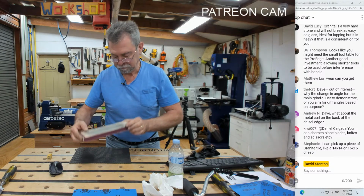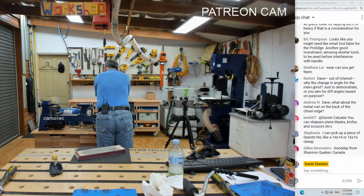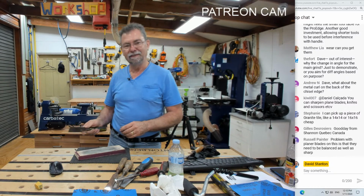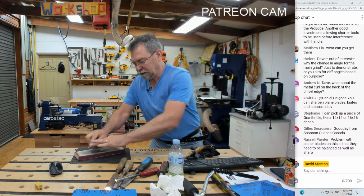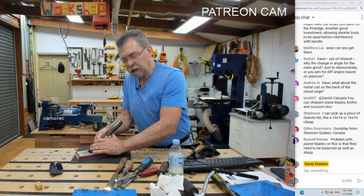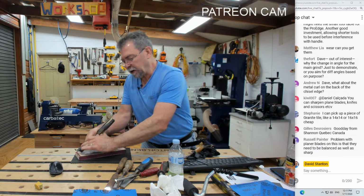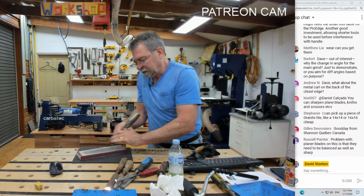See that? Don't go doing this. Not going to work. Not going to be any good. All righty. Let's go with this one to start with. It's so nice. I'm going to pull it backwards. And now I'm going to throw it over this side, and I'm just guessing. I could use the Veritas honing guide, but I'm going to guess. I'm guessing I'm around 30 degrees, which is going to be working my micro bevel.